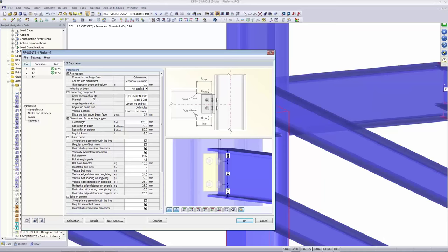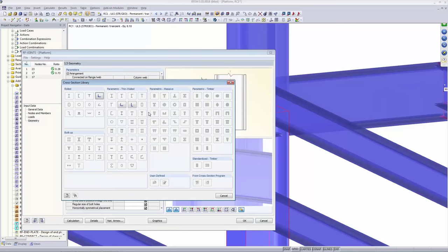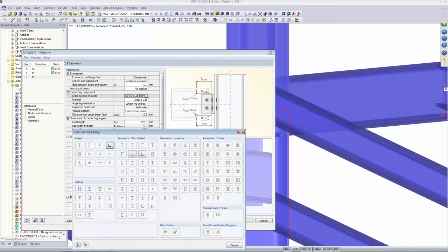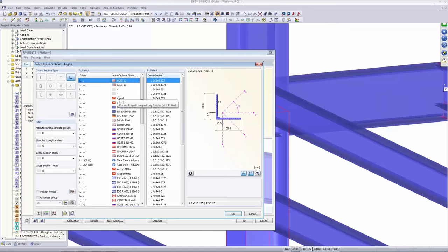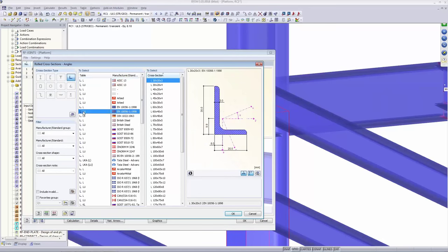So we have to adjust the cleat itself. So I choose a different angle. This opens just the library. So I pressed the button with the three dots and it opens the library. And I want to choose a rolled angle, in accordance to the Eurocode. And this is an unequal angle I want to choose, and it's the one with dimensions 100 by 75 by 8. So it's down here. This is the one I want to use. Okay,